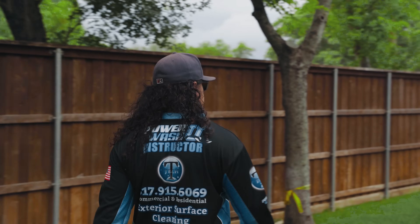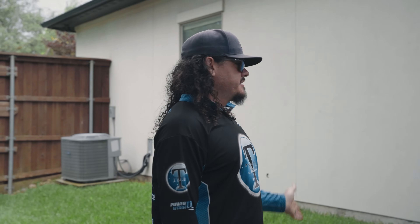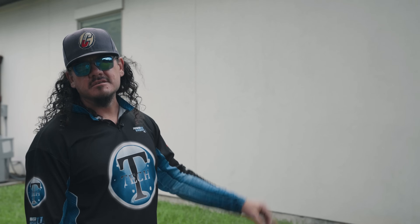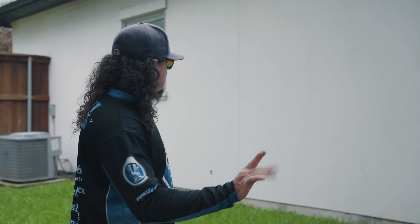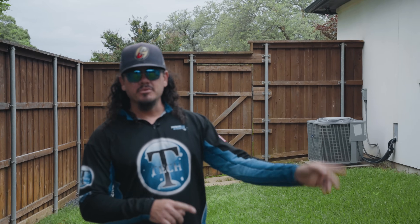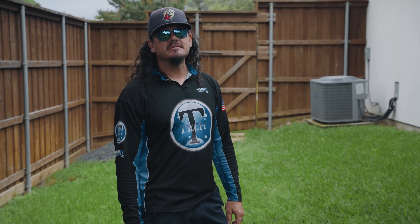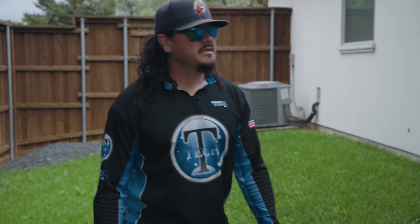It's really not too dirty, so that's a good thing. We do have a little bit of splash-up on the bottom of the stucco. If the gutters are overflowing or you've got a big downpour splashing up there and getting all that dirt on the surface — the dirt can be rinsed away, but a lot of the time it does create a stain. So I always keep Rust Remover Plus on the truck. Stucco tends to respond really well to Rust Remover Plus, as well as that pool deck material — it lightens up the rust stains in a very short period of time.